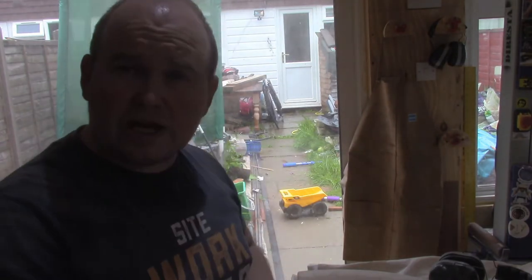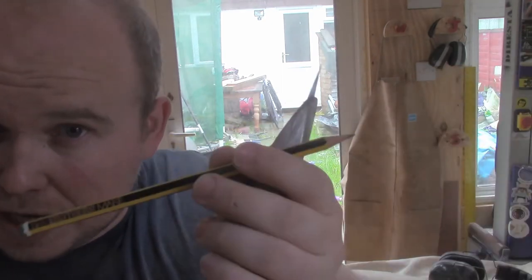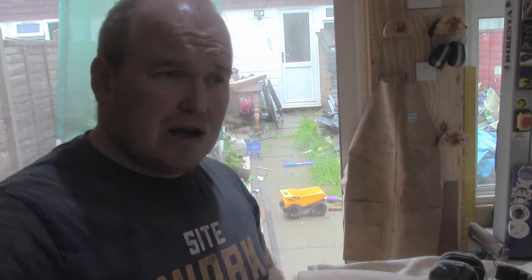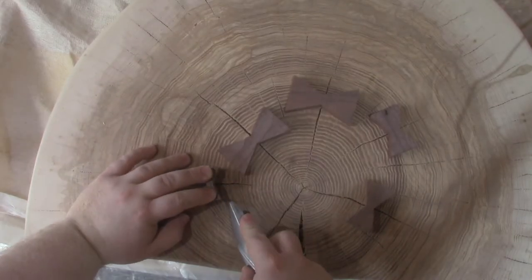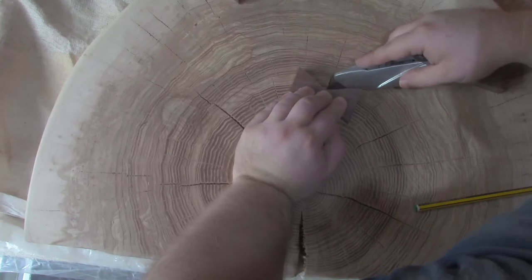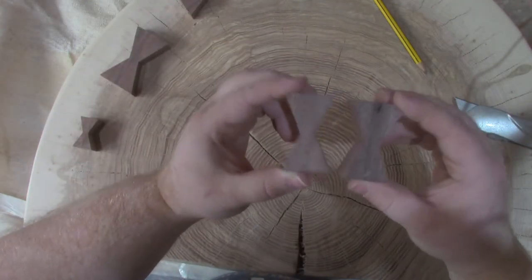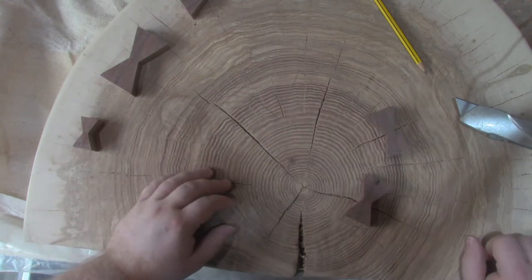Okay so now that they're all in place I'm going to be turning to my friend Mr. Stanley Blade. This comes in very useful — a Stanley blade is nice and thin and it also starts cutting the wood for you as well. So when you start chipping in with a router or even a chisel you're going to have nice clean edges. There's a good tip for you. Because I've got two similar shapes I've marked them differently — this one has a circle and this one has a line, so I know not to mix them up.